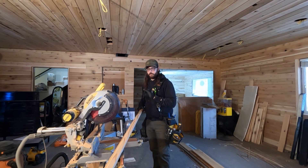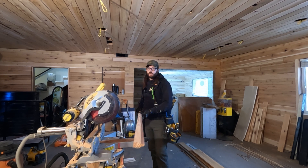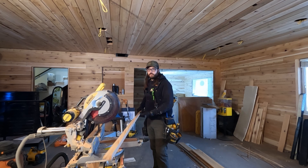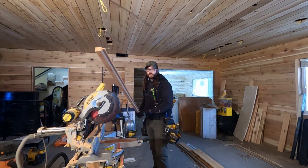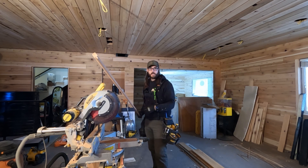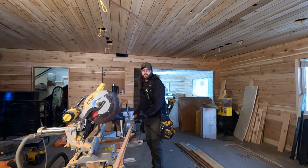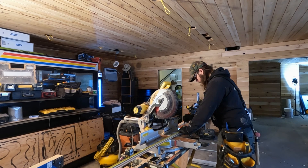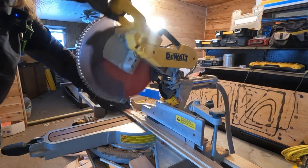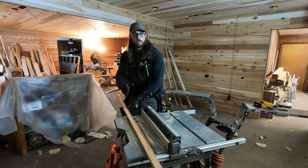To do that I'm going to use an off-cut from some of this tongue and groove cedar. We've been using the actual tongue and groove cedar itself to make all of our interior trim and jamb extensions. When you order bunks and bunks of this tongue and groove cedar you get a lot of waste, so instead of trashing the whole board we're able to use a good chunk of it for filler strips and casing. I've got a ten-foot strip here — I'll mark it at ninety-five and a half, cut it to length, then take it over to the table saw, set our blade to thirteen-sixteenths, and get it ripped down.